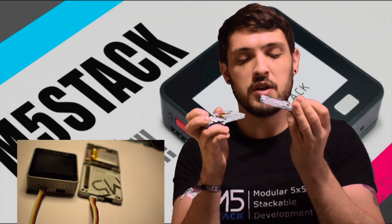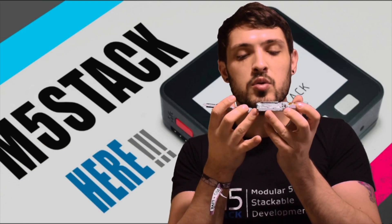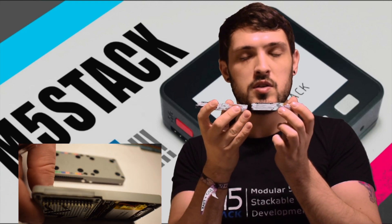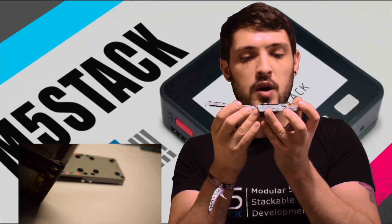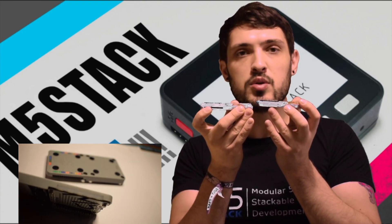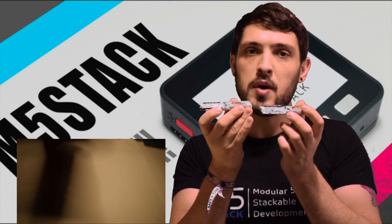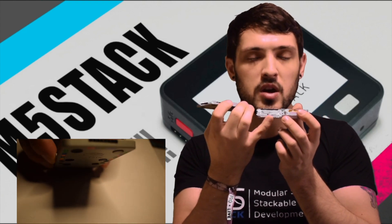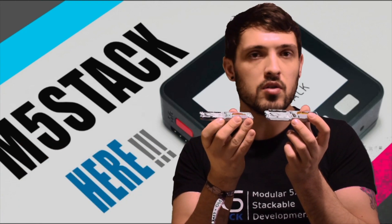Here we have a little bit of a trade-off. On the Faces 2, there are RGB LED bars just like in the M5Go and Fire editions. But the trade-off is that if you have these bars on the side, the pinouts that were on the original version are no longer available. It depends what you're after in your application — perhaps you just want some kind of signaling device using the LEDs, rather than having all those ports.